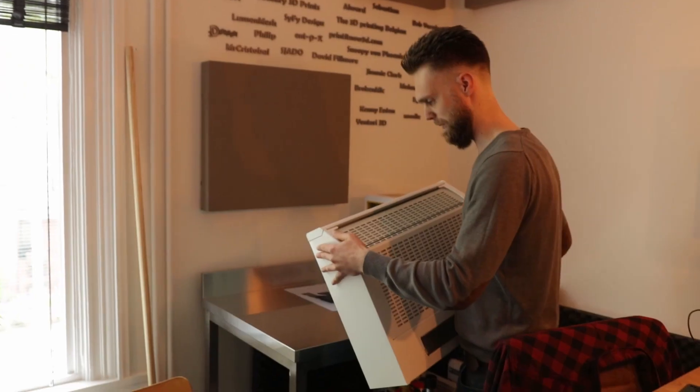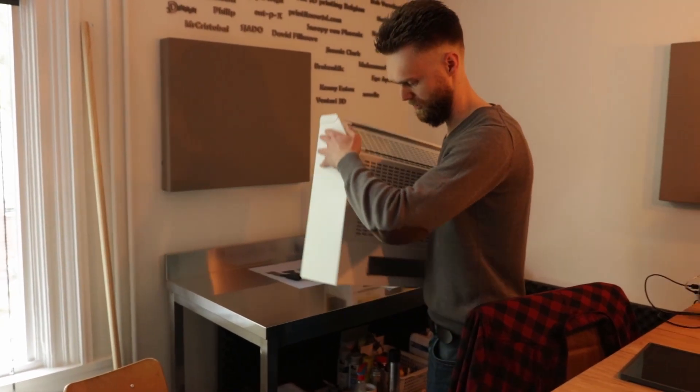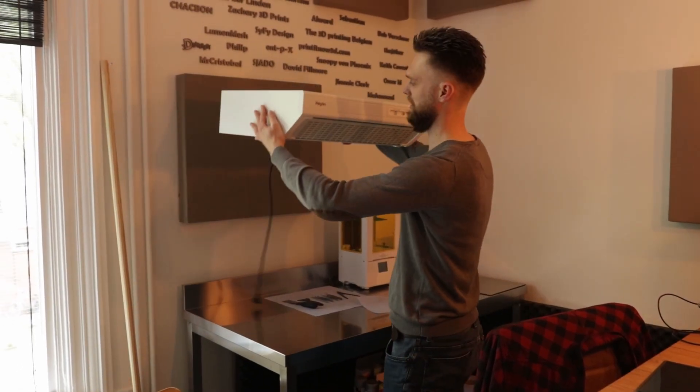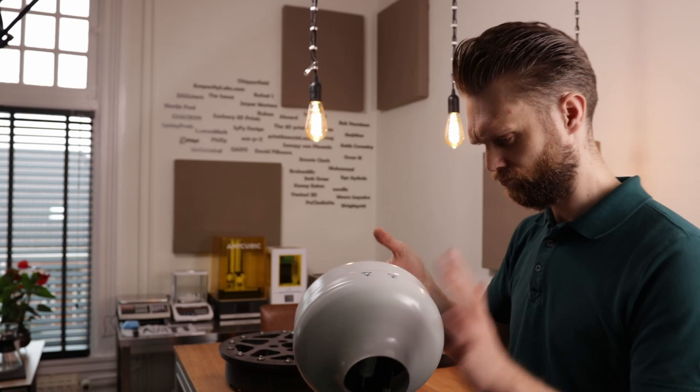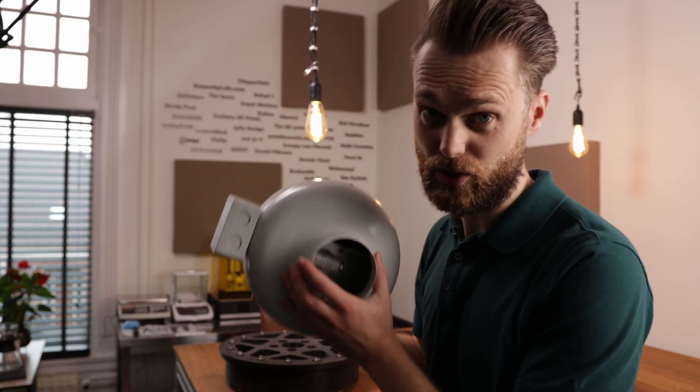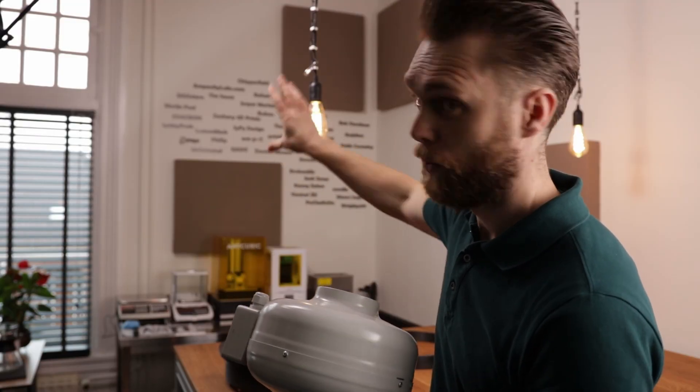But before I'm going to just dissolve everything, I must create a safe environment to do that. In the video in which I introduced the studio, I talked about using an extraction hood. I wanted to place it up the table over there, but then I thought the inside of that extraction hood is completely made out of plastic and it looked like ABS. I've got this steel fan and this can be placed within a tube, and I'm going to mount that tube on the wall over there.